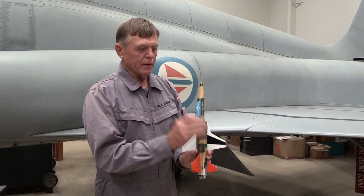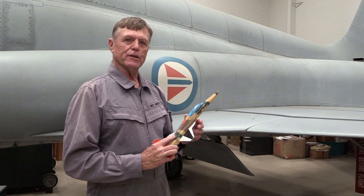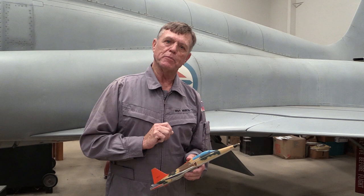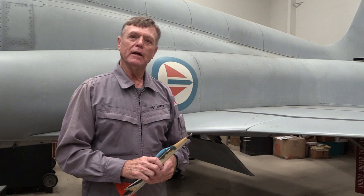So for positive angles of attack, high angle of attack maneuvering, the LEX was great. And if you see an F-18, you'll see that the LEX is even larger, and all of that is called vortex-induced lift. That's positive high angles of attack maneuvering. And it was an accidental find that was based on this little motor driving that flap.